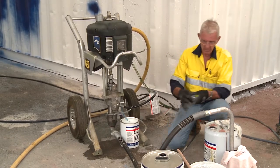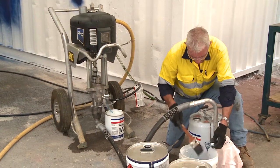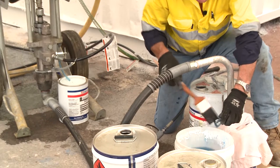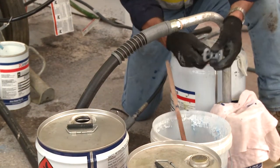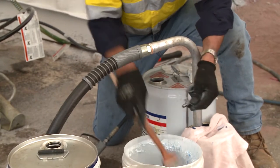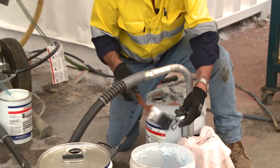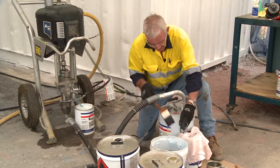What we need to do is clean the tip and make sure it's kept clean. Wash the tip and tip housing — keep it nice and clean. It's imperative. The right thinners for the right job is what you need. By rinsing it off like this we can inspect it to ensure there are no fatigue cracks in the body of the tip housing, and it gives us an opportunity to inspect the tip itself. The only way you can identify tip wear is by the way it sprays — you can't look at a tip with the naked eye and say it's worn. You'll establish wear by actually pulling the trigger and atomizing material through the tip. Make sure you have appropriate PPE on when washing this up, because the solvents are quite volatile and exacerbated in this temperature.